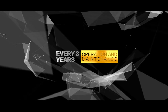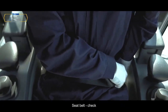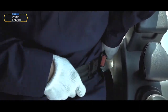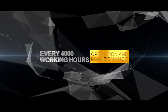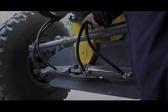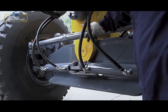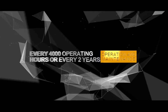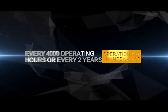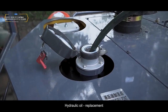Every 3 years. Seat belt, check. Every 4,000 working hours. Steering system pipeline, check, replacement. Every 4,000 operating hours or every 2 years. Hydraulic oil, replacement.